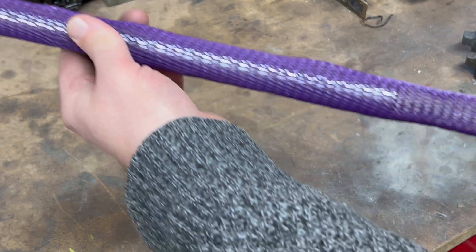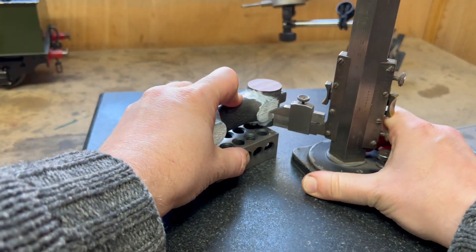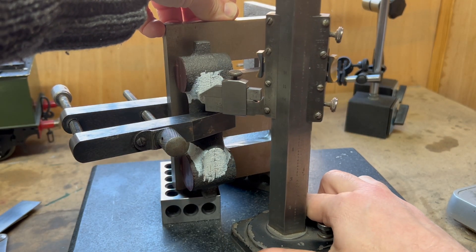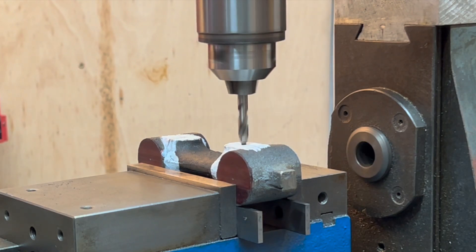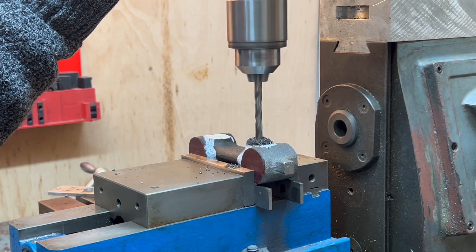Here's a pretty substantial piece of 7/8 inch silver steel. These are the arms of the pillar tool. They're a bit of an odd shape, so I'm using my surface plate and height gauge to mark out where the bores are going to be. Here I'm spotting out with a spot drill and then I'll be drilling through various sizes to get the correct diameter.